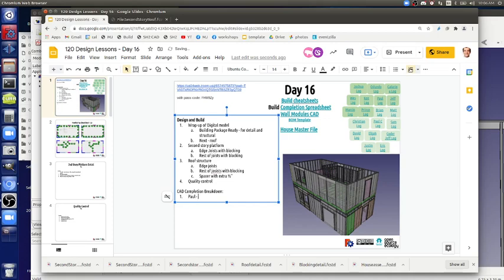Okay, so Paul: second story platform plywood. You see that there's 4, 6, and 8 foot pieces, right? Yeah, I was going to ask how big the panels were. I assume they were 4x8. 4x8, exactly. Same thing. And the verification point is they all have to end up on the middle of a joist. That's how they're going to get attached. So that's the verification point.